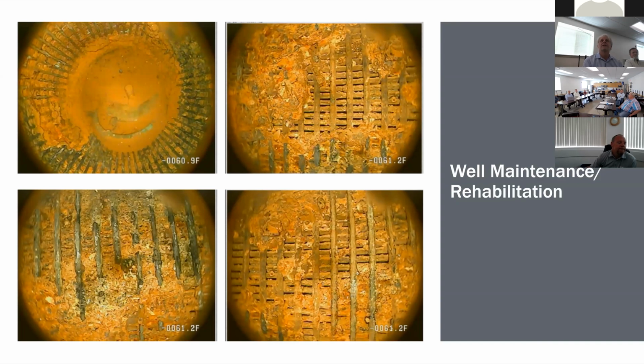on the well screen. This is a continuous wire wrap well screen. The well's about 50 or 60 years old, and it was pretty heavily encrusted. So a lot of the flow is only coming through a small open area of the screen, and that actually ends up exacerbating a pre-existing problem that you may or may not be aware of, because you're drastically exceeding those fluid entrance velocities, which is causing more corrosion or more precipitation of some mineral incrustations and can compound some problems.